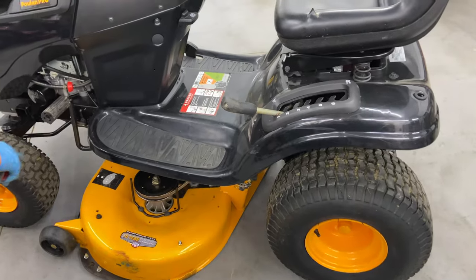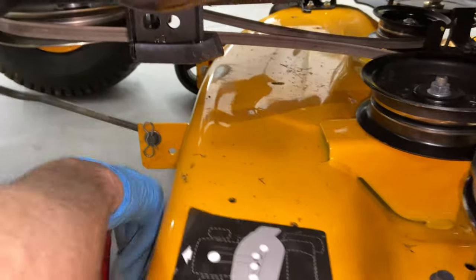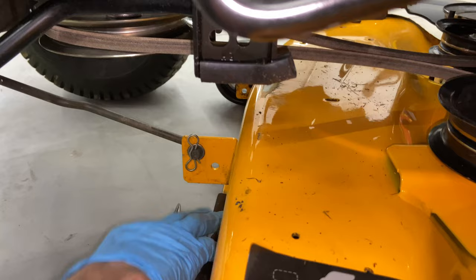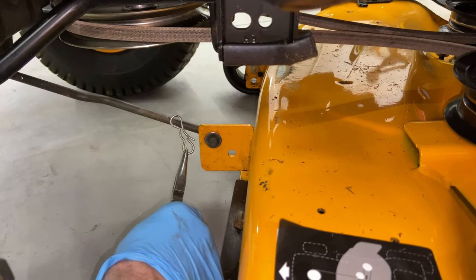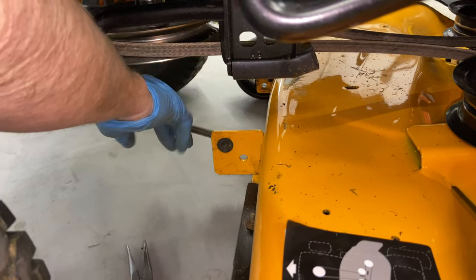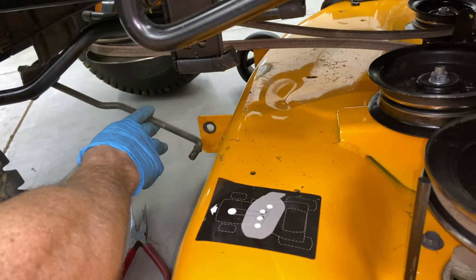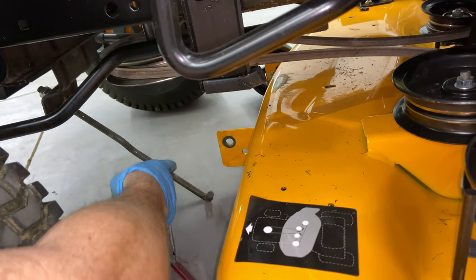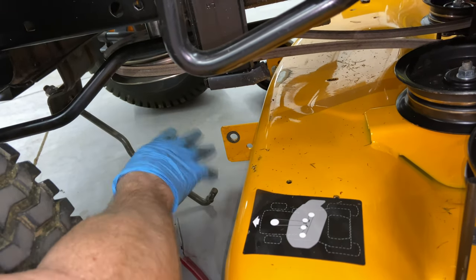Let's start by taking the front clip off the front hanger, right here. You can check to see if it's loose — if it is, you don't need to use the pry bar. Just take your clip out. This is what I call a butterfly bow tie clip; they work very nicely. Then remove the washer and push the bracket out to the side. As far as the rod goes, if you're going to have the mower deck off for a long period of time, take the rod out of the front of the machine so you don't jackknife and bend it — I've seen it happen. Just make sure when you put it back, you put it back in the right spot.